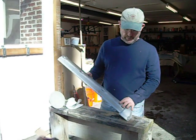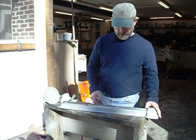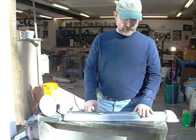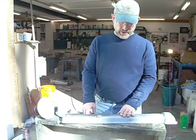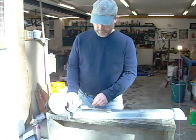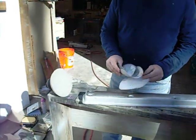This end is as bead blasted. For the rest of the part, we'll go through putting a polish on it. Now, aluminum doesn't corrode, but it does react with the air, and it oxidizes — the oxidation on the face of the aluminum will give it a gray appearance. What I did on this part was I sanded it with gradually finer grits of sandpaper.